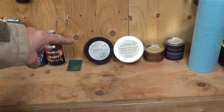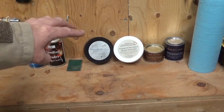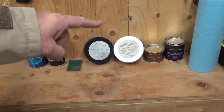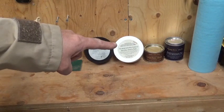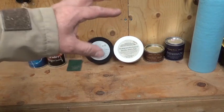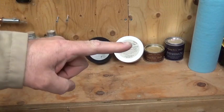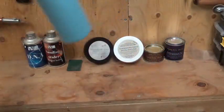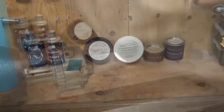After that I'll use Yorkshire Grit original and then Yorkshire Grit microfine. Once I've done that, that brings me to the 1000 grit and then the micromesh level of sanding equivalent. Then I will move on to Hampshire Sheen High Gloss and then a microcrystalline finish, which will be my hard-wearing fingerprint proof finish. All of these will be applied with paper towel, which I have at the end here. And it really is quite simple. So let's get this done.